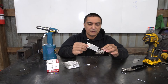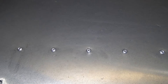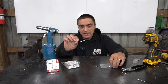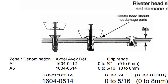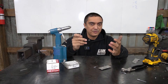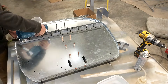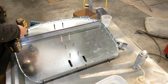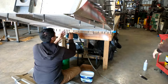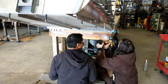I first heard about these rivets when I was doing research for building a Zenith aircraft, long before I bought my kit. When I actually took the rudder build class, I got to use them firsthand and realized how quick and easy they are to use. The Zenith method involves taking a flathead or countersunk rivet and then using a special riveting tip to pull it into a dome head shape. Zenith sells riveting heads for the riveting guns — I modified my own in the lathe. This gives you a very strong, very tight pulled rivet that is also very quick to install. My Zenith Cruiser is held together with thousands of these. These rivets are why it's so fast and easy to build a Zenith aircraft — you don't have to have a bucking tool on one side while hammering the rivet on the other. You can literally pull these and go, pull the stems out, dispose of the stems, and you're building an aircraft very quickly.